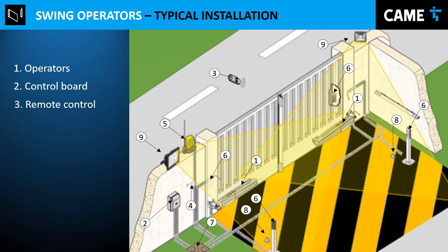The remote control is optional, but usually clients want a remote control to open and close the gate. The selector is basically a wired control — it can be a keypad, a button, or a key selector; anything that can control the gate with wires. A warning light is also optional, but I recommend it — having a warning light blinking warns anyone nearby that the gate is moving or about to close automatically. Photo cells: we recommend always having two pairs of photo cells, one pair for the outside and one for the inside.